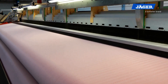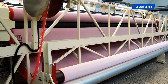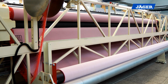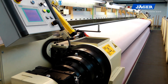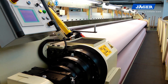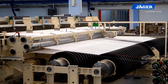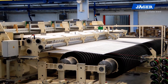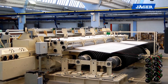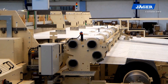Due to the three-roll take-up arranged at the top, a low fell line movement is reached. The cloth take-up rolls are coated with a vulcanized polyurethane coating. The machine regulation is done by positively working AC servo motors arranged on both sides. Designs with up to four warp beams are possible. The warp let-off systems are equipped with AC servo drives working either crimp factor or warp tension control. Each warp beam has its own warp tension measuring system in order to allow an independent control of each warp beam.